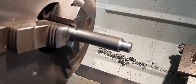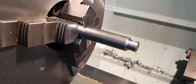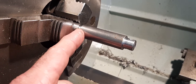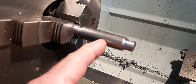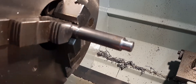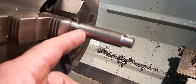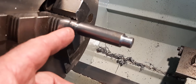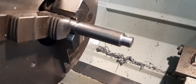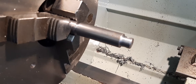The video's not totally focusing — it seems it's picking up on too many things around, picking up on the swarf in the background rather than the part itself. Anyway, I'll get you set up at the end of the lathe. So we've got the raw part — you've got that reduced section at the end there. We'll just go along and cut the thread along here. We hold it pretty short in the actual chuck itself, mostly just to stop it deflecting. The bar is three-quarter. I just put a bit of a step cut in there — a bit of a landing — which I park the tool in. Because this is a metric machine cutting a kind of imperial thread, I need to drive the carriage back out rather than keep the half-nut engaged.